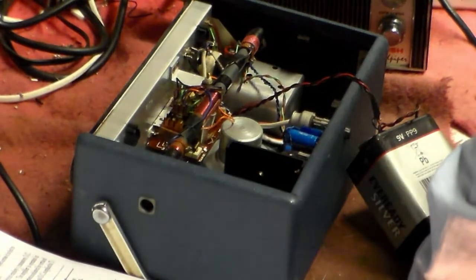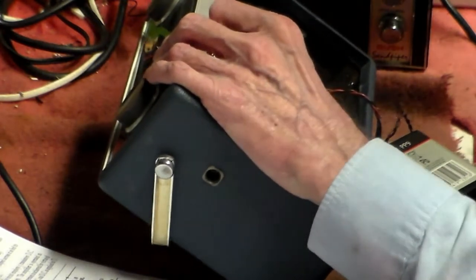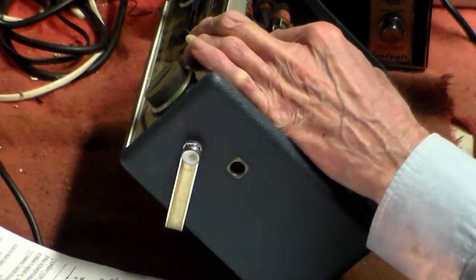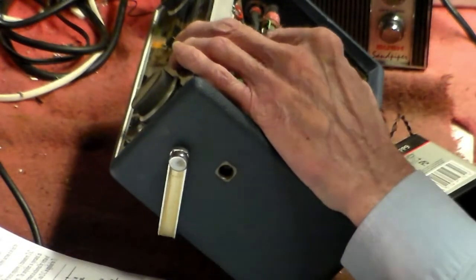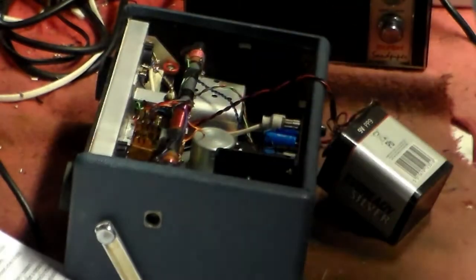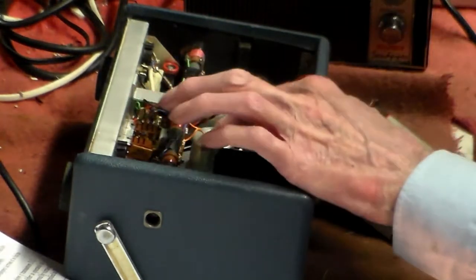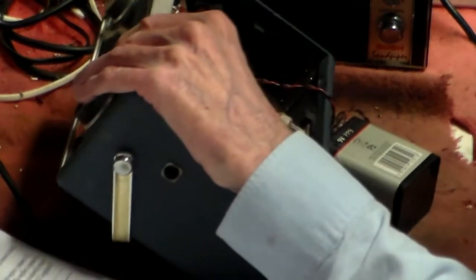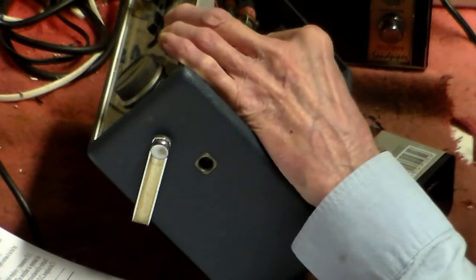We know we've got L5, which is behind the antenna coil here. I don't want to touch that one because long wave is so good. That's pretty obvious. Now, none of the wiring appears to have been fiddled about with. But like I said, people do like to have a play around with these sets, so it does happen. Now, that on the left here, that is TC4. And so somewhere near it, there will be TC3. And TC3 is the one we want.